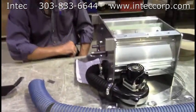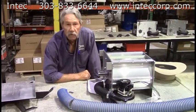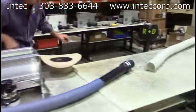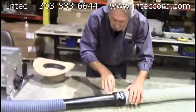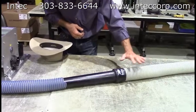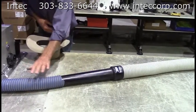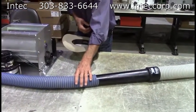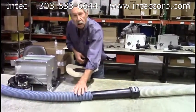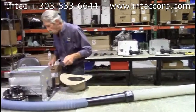If you've got new hose and it's still not helping enough, consider adding an extra length of hose. I use a three-inch hose coming in with a three-to-two-and-a-half swivel reducer. What you would run is a hundred feet of three-inch standard ribbed hose, then a three-to-two-and-a-half reducer, and then into a piece of two-and-a-half-inch hose that's fifty feet long. When you reduce it down like this, it keeps the pressure up in the line and helps to beat the material against the inside of the hose and fluff it up even more.